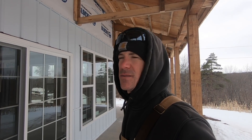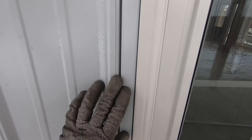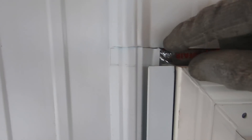I got a little problem here, which I knew I would have based on where this door was and where my ribs were. So I'm going to show you how I'm going to handle it. We have this rib that dies right here in this J-trim, and I knew this was going to happen. I didn't really have a choice with my post spacing. The good thing is it is under my porch, so water is really not going to get up here anyway, but I still want to do it right.